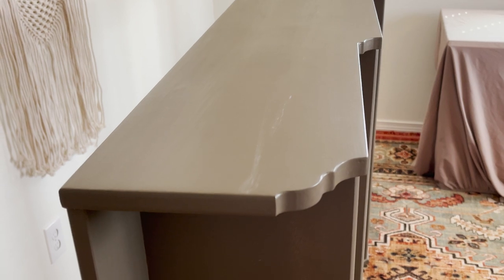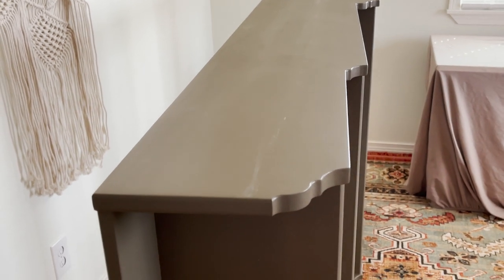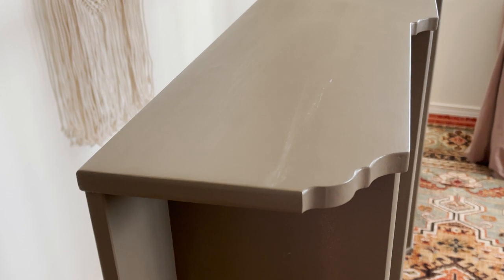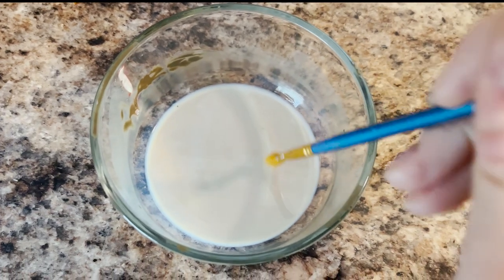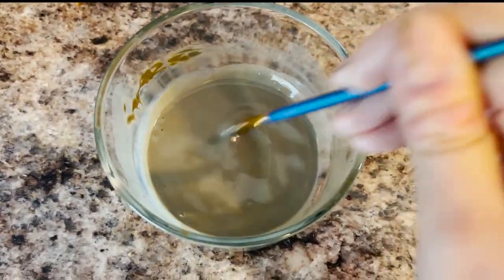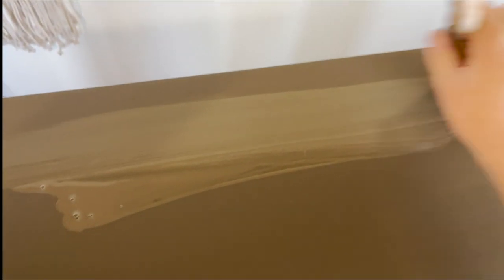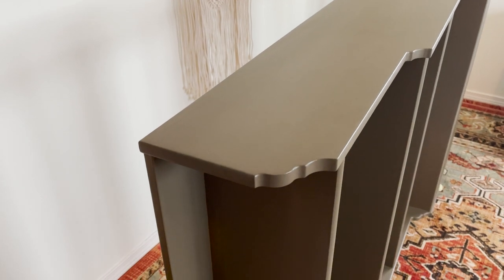Okay, so I want to show you guys a little hack. This can kind of happen when you're brushing, especially with like a satin finish. You can see right there where the light's hitting it — there's kind of like a little drag mark, and this is just common with satin finishes as they're less forgiving. So what I do is I made a wash of the paint — a very watery wash. I did like one little spoonful of paint to just a bunch of water, mixed it all up. Then I took my zebra wedge brush and just painted over the top so that it was a really wet coat. The reason that you get the drag marks is the paint starts to dry and then if the edge of your brush goes over it, that'll happen. But with a wash, since it's so wet, it will just even everything out. And then once that's dry, you can see that that drag mark is no longer there — it has basically been camouflaged in.